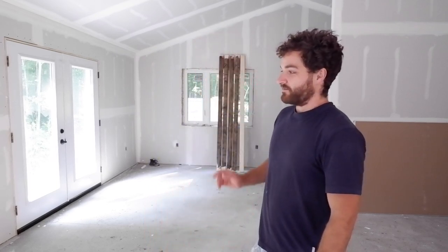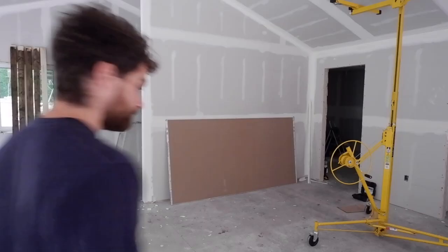Hopefully I can do those. I'll probably leave the ceiling until tomorrow. Not sure if it will be a part of this video or not, depending on how long it is. And then I might do the second coat of mud in that alcove where that red mud is, which will be in a separate video altogether, and I'll be using blue mud for that probably. But as for today, mix up some mud, start on these flats, and check the inside corners to see if they're dry. Let's go.